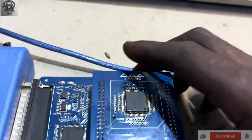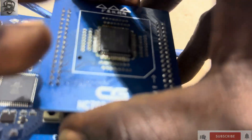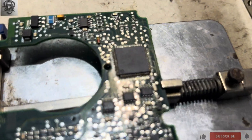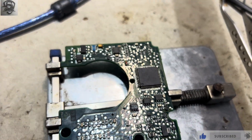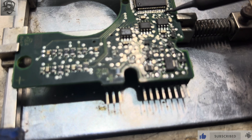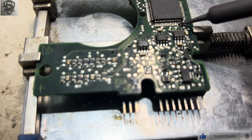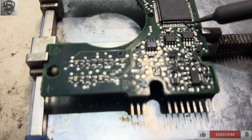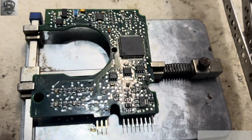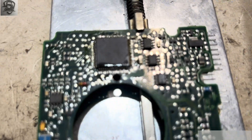Let me pause here. I want to pause on this session and then take this chip, desolder it, and resolder it over here on the PCB in its normal position. I'm going to use the soldering iron to re-lead it so the pins sit firmly. I need to add flux onto it. Let me pause here to explain one or two things for someone who does not know about these things.